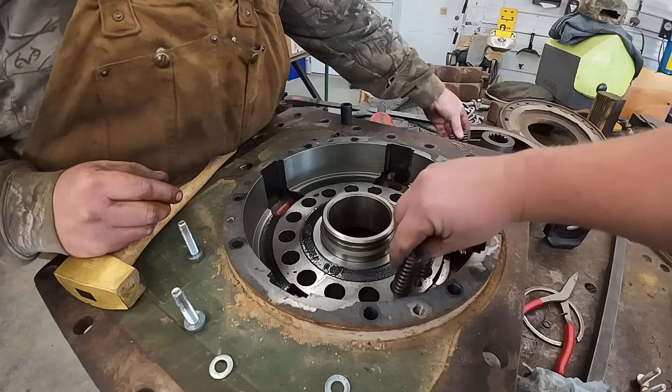No codes. Well, we thought we were going to get into something epic and fix a computer on YouTube, but we didn't. Speed sensor was reading RPM. Replaced it and it fixed it. Usually they don't read at all — usually they're broken and we replace them and they'll steer right. But I've never seen one do that. It was reading perfect RPM through the dash monitor, but it was not steering straight. Put it in there and she's perfect.